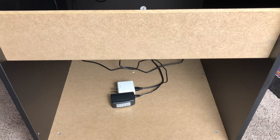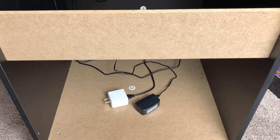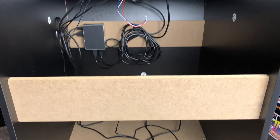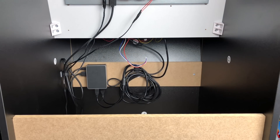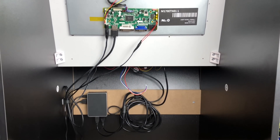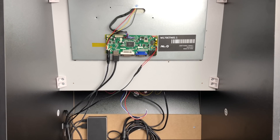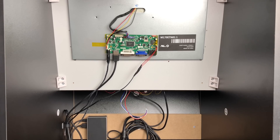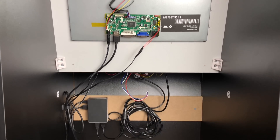Here's a quick look at the internals. I have my 12V adapter for the LCD controller and my 5V for the Raspberry Pi. I just need to pick up another power strip — I didn't want to rob it from another project. Here we have the Raspberry Pi and the mess of wiring for the encoders, and the LCD controller. I'm going to leave links for everything I used in the description. If you want to install a Pi in an Arcade 1UP, I'm also going to leave a link to that tutorial video.